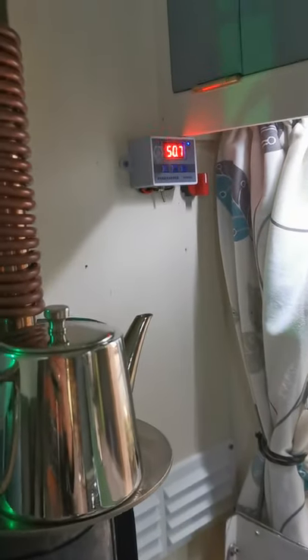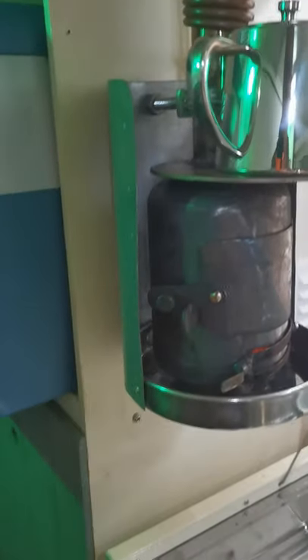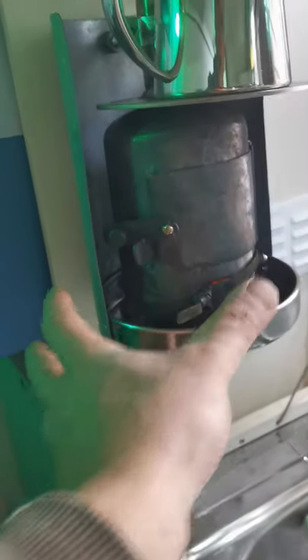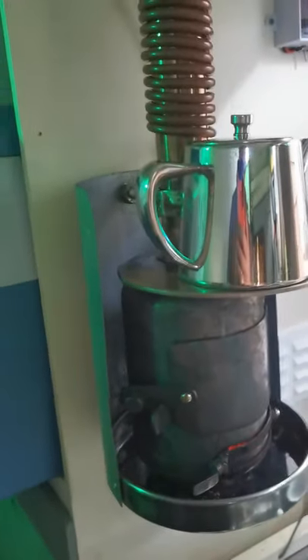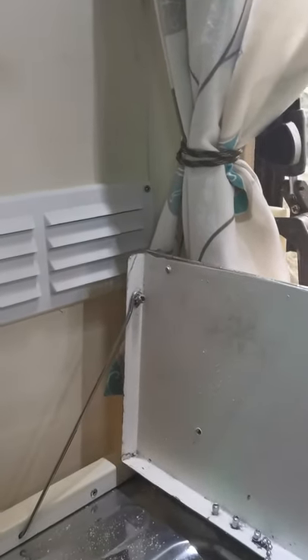You might just hear that — the pump's kicked in, so the hot water that's in this pipe is now going into the hot water tank. This burner is only maybe six inches high and four inches across, and the flue is 38mm. With any combustion system I've got an alarm over here that monitors my carbon monoxide. I've also got a vent here which goes straight to outside through that vent you saw — it can't be closed, so there's always fresh air coming in. I also have a roof vent which I can open if I want.